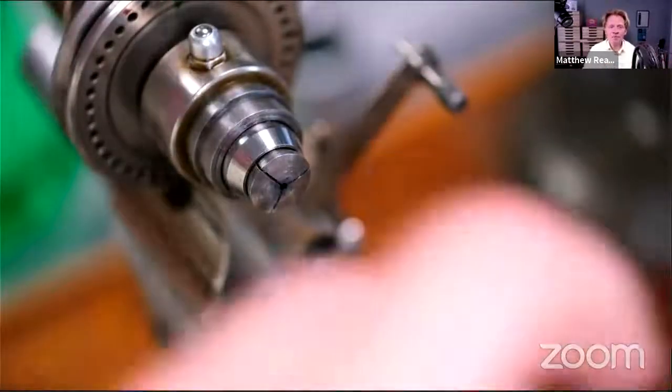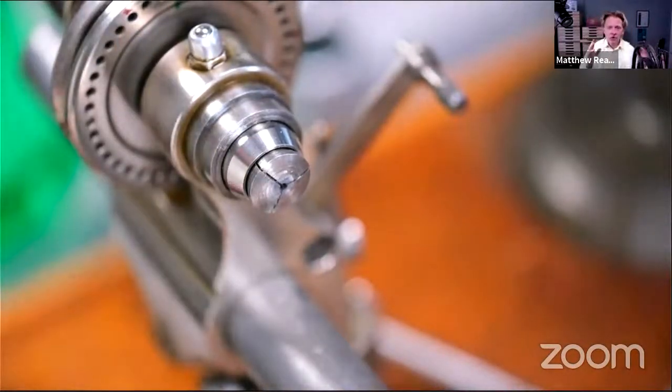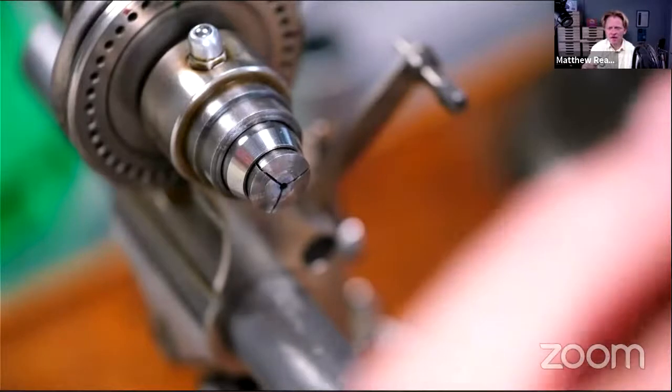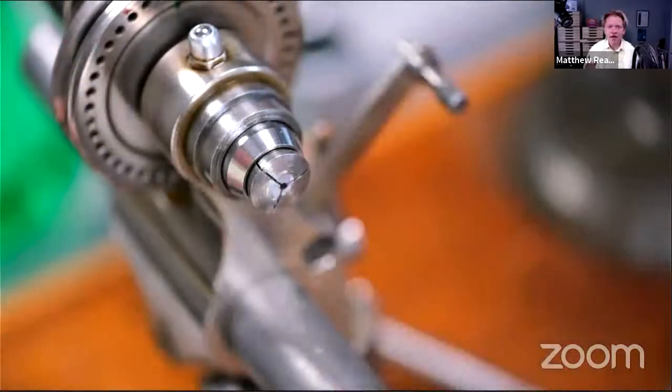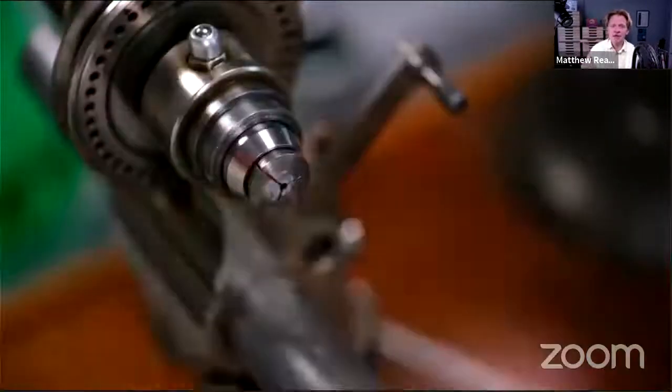You know, mentioning no names, on some fora, people go crazy about whether the pivot's sticking out of the hole or it's a little bit shorter than the bearing. It's not something that exercises me. But maybe this pivot's a bit long. Do you think we should just whip a bit off it? Is this whole disaster going to happen if the pivot's a bit short for the hole? I have seen it where the pivot wears down inside, and of course it pushes it forward.